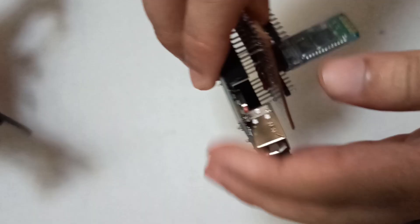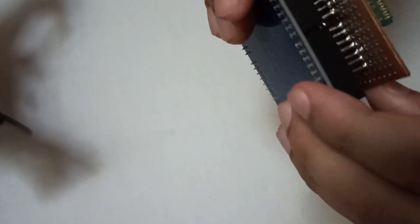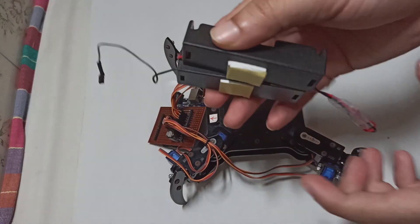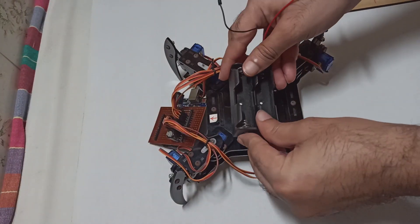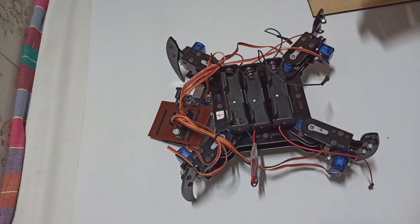It is easy to make complex circuits and our spider robot also looks good. Please have a look at the schematic if you found this confusing. The operating voltage for servo motors is 6V and the voltage provided by two lithium ions is about 7.2V. Therefore, we will use two 4007 diodes in series with lithium ion batteries. Please be careful with lithium ion batteries.